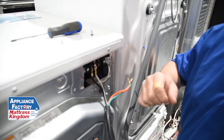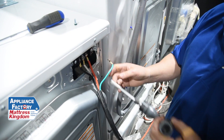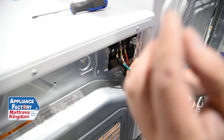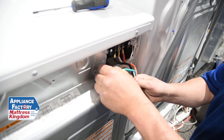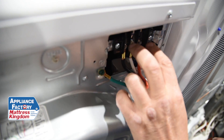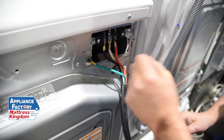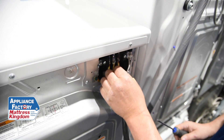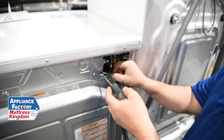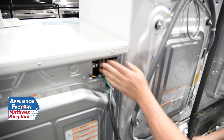Give each connection a solid, good squeeze — but don't overdo it. Then screw in the green ground wire. This is just for demonstration purposes, but it would work if plugged in. Once done, check that you can't move the wires left or right — there's a little designed movement, but if a wire swings freely, it's not tight enough. Give it another quarter to half a turn until it's solid. Then push the wires in and put the cover back, and we're basically done.